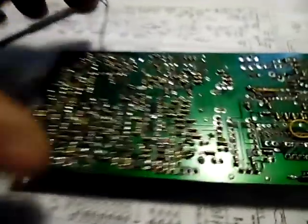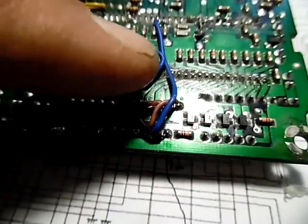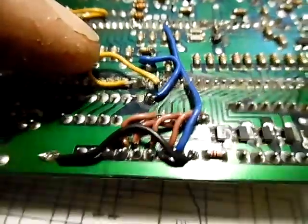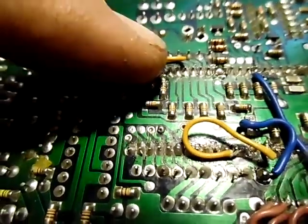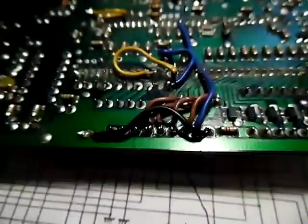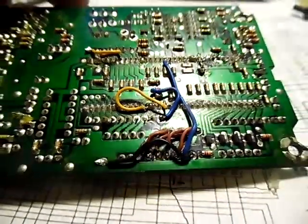What I did was come in here and cut the traces between this resistor bank and the socket — the main socket for the screen — and jumped all that out. Then I jumped this pin here and jumped these together, because I can't rebuild the traces but I can jump it together and make it work. This is the frequency mod that would have been done to a 2510, but I did it here on this one after I got it to where it would actually transmit and receive on 10 meters.